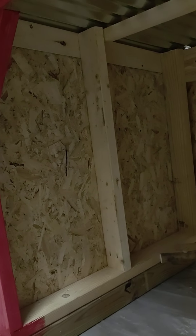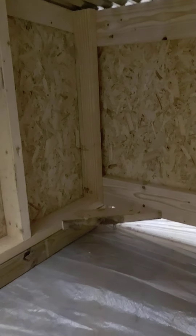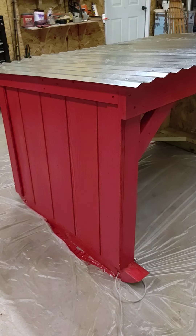Super easy design — just put the 4x4s on the bottom, frame the sides up, put just a small slope on there. I don't even know what that pitch is, but it's not very much. I did use Kreg screws in the back here in the corners to hold it together. That little brace should maybe have something over it so something doesn't get their foot caught in there — that's something I can do later. All of this is screwed together with 3-inch square drive screws because that's the only thing furniture builders use, so this thing will definitely not be coming apart anytime soon.